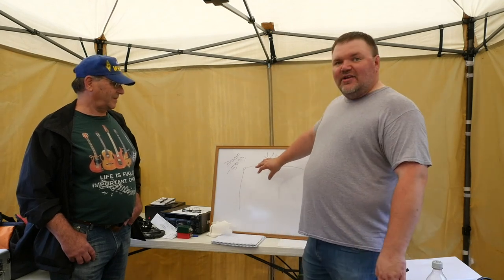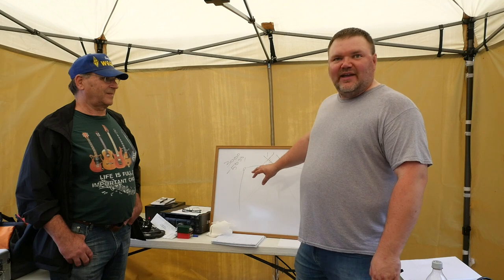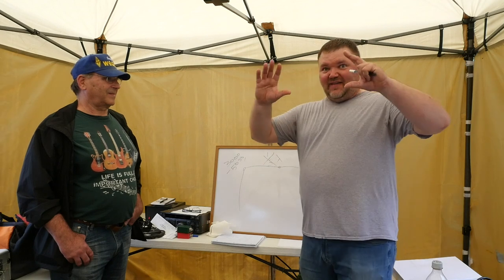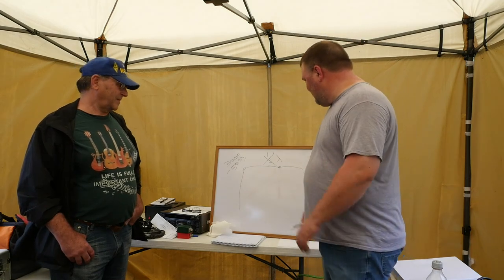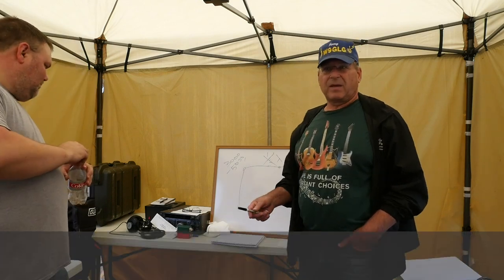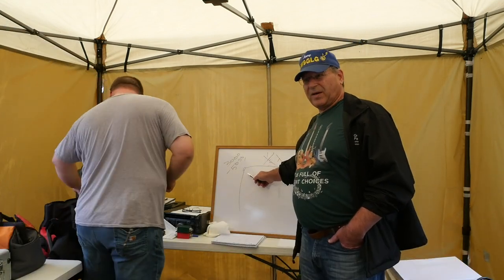There's a lot of experimentation here, but the nice thing is it's forgiving — like an old Kenwood 520, you can't kill these things. I had a tree branch fall on my antenna, took my power lines and antenna down, and I was back up in two days. They make wire every day, it's cheap — especially if you're an electrician. My ten minutes are up, so I'll let Jerry take over. Joe covered a lot already on random wire. The reason you want to use a random wire rather than a half-wave is to get your impedance closer to 450 ohms.